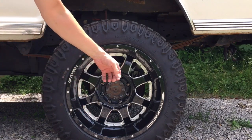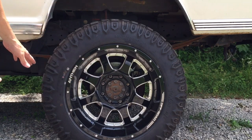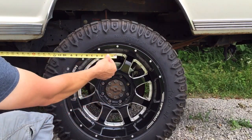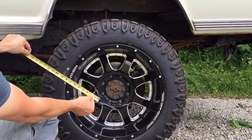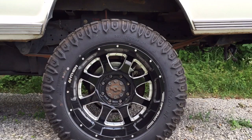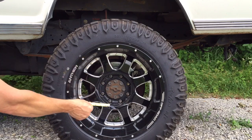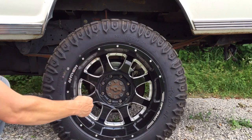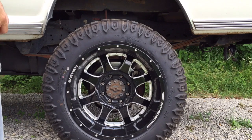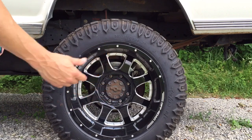That's why a traction bar won't go straight forward — it's going to go slightly uphill, which is good because that's what it takes to get to your frame rail anyway. A lot of what you need to decide is what arc your traction bars are going to travel on. If they were super short and super steep, they'd be traveling on a tight arc. If your bars were super long and super flat, they'd have almost no arc at all, but your axle would need to go straight up and down to accommodate that. So it's splitting the difference — putting the arc at the right place.